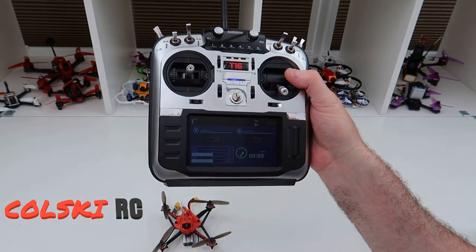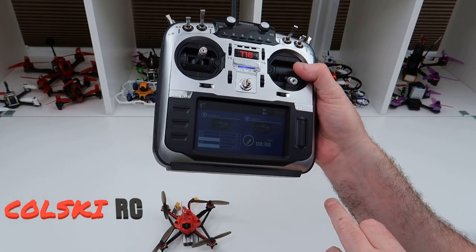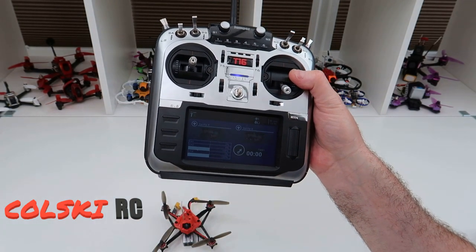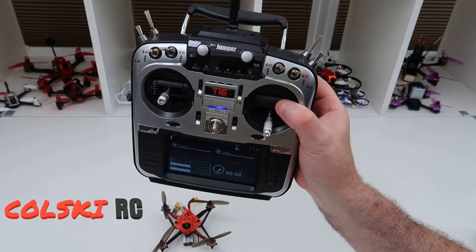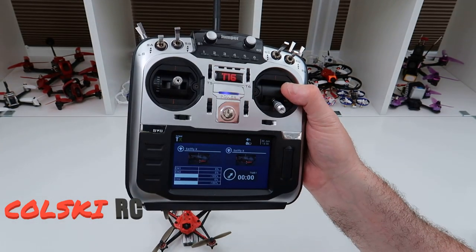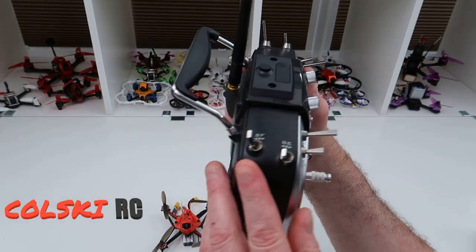The batteries don't last that long. I've got 3000 milliamp hour 18650s in here. They are branded, but whether they're real or not, I don't know, because that's the biggest problem with buying 18650s. Are you getting branded batteries or not? Or is it just some Mickey Mouse ones that don't last 2 minutes? By the way, this thing's eating batteries, I'm guessing these Samsung branded ones are not really Samsung, even though I bought them from Amazon.